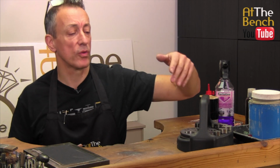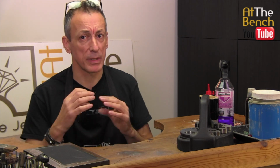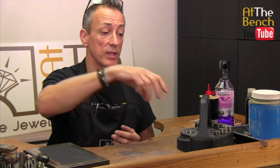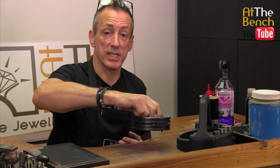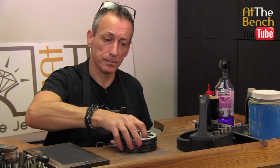You do have to make sure that the faces on the cutters are really, really nice and crisp and not necessarily sharp, but clean and crisp and unmarked. So then when the punch goes through the actual main body itself, it will produce those gorgeous, gorgeous discs.